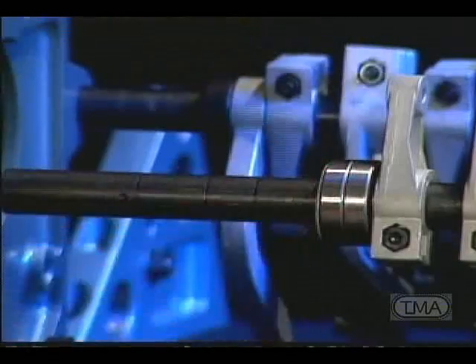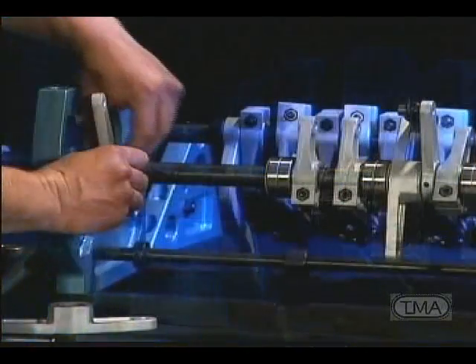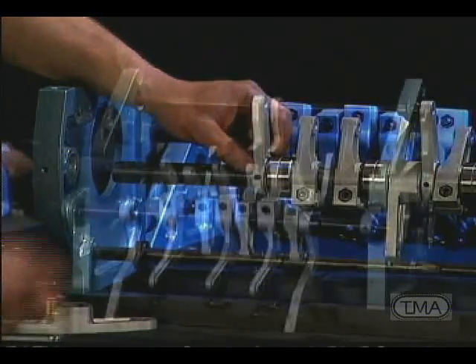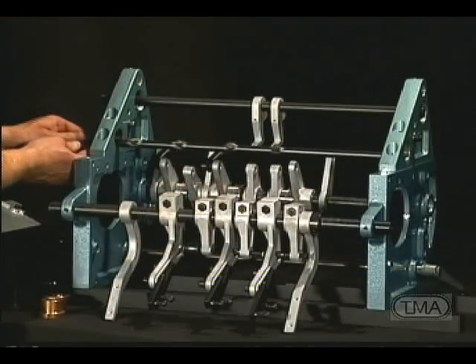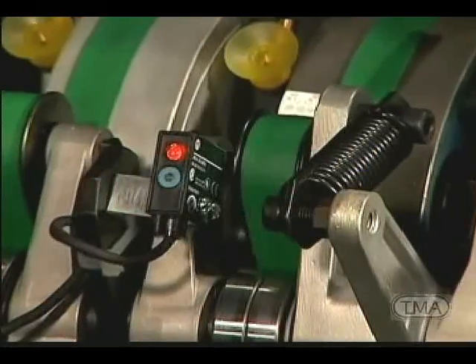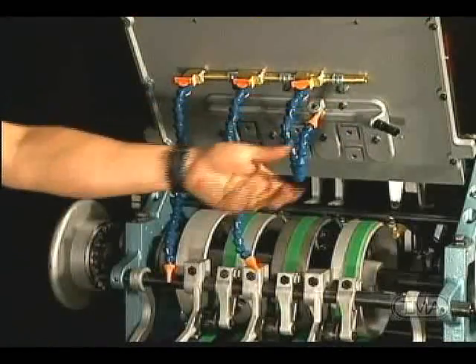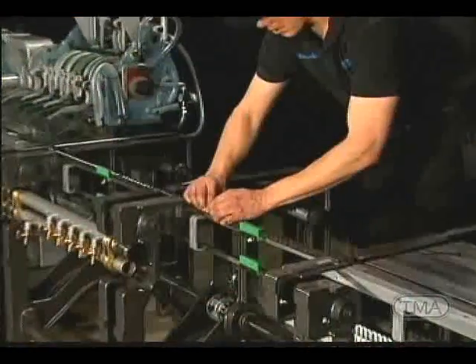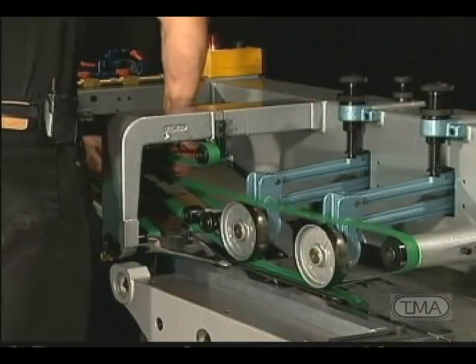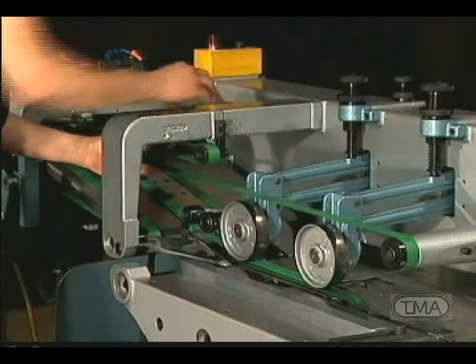After the feeder heads are completely disassembled, the innovations from years of specializing on the 227 are evident in the numerous modifications made to each feeder, such as threaded sucker bars, center drum detection, flexible air deflectors, coated grippers, a new carrier chain, pocket chains, a completely rebuilt conveyor, and improvements to the delivery system.